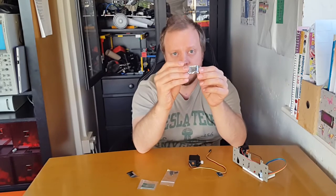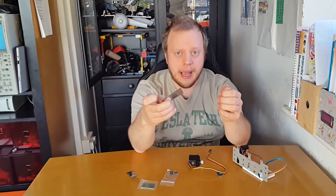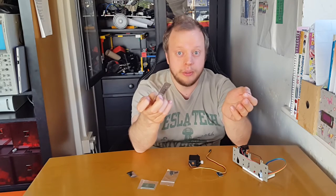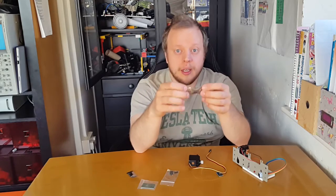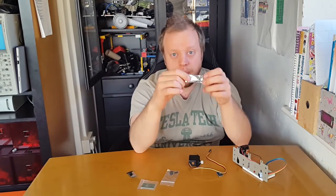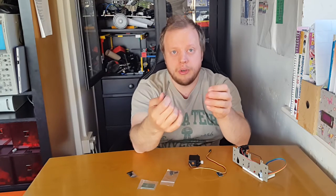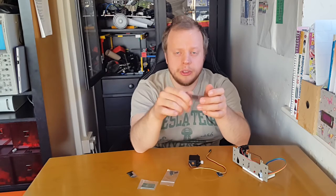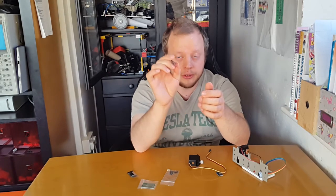And these are the other modules. These modules are low cost — where adding Wi-Fi to a device might have cost you 10, 20, even 30 quid, these things come in at three or four pounds each, which is extremely cheap for what they do. They've got plenty of flash, they run on 3.3 volts, they use about 300 milliamps maximum and then have very low current on sleep.